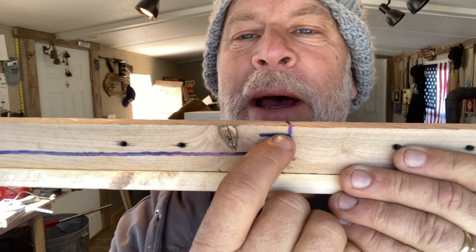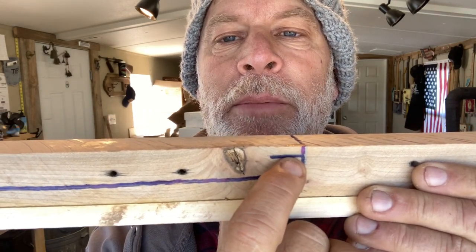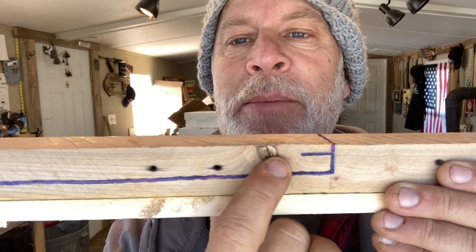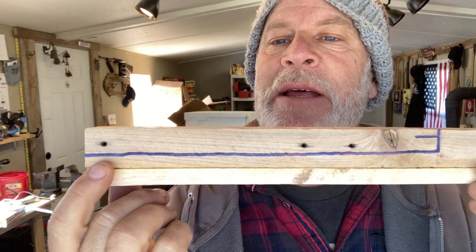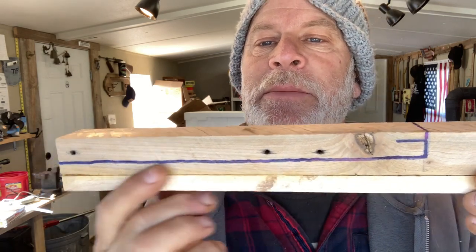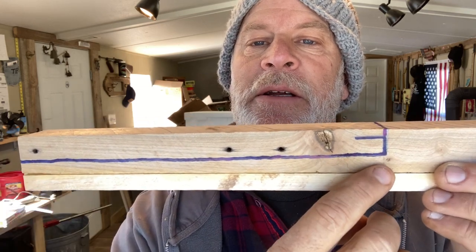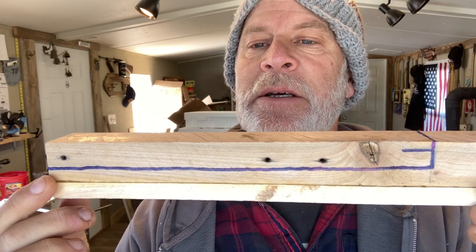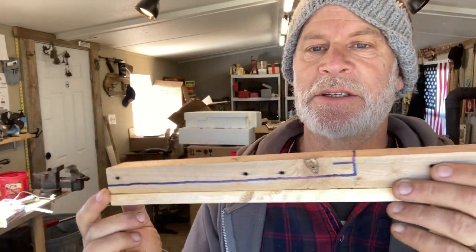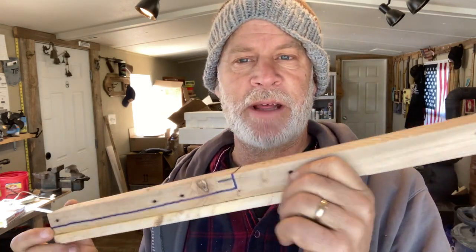And then I added the amount that I want the fretboard to stick up over the plane of the cigar or the pallet box. And then of course I incorporated a slight, ever so slight back angle. You probably can't tell here, but this is thinner right here than it is here, thicker. Thicker here, then it tapers down to thinner. Again, it's very subtle. It's gonna have a subtle back angle. So that's how you do that, if that's how you wanna do that.